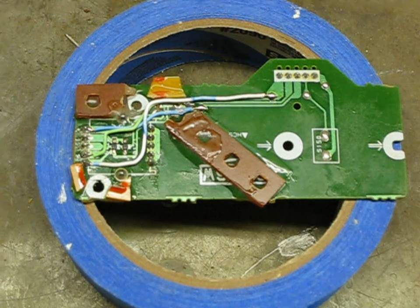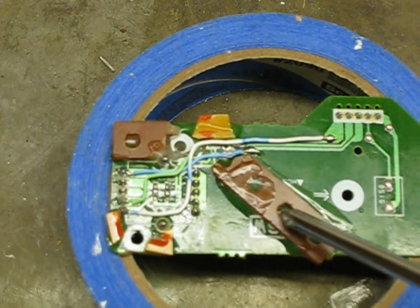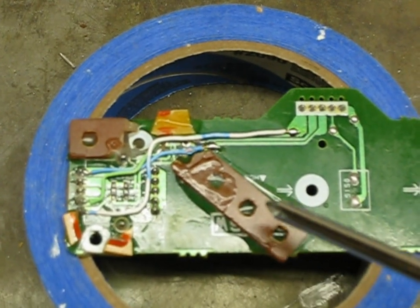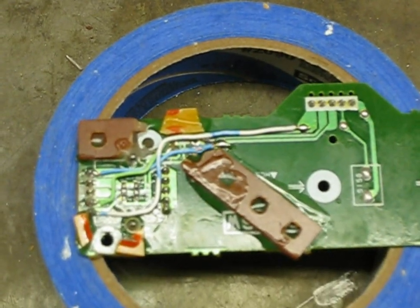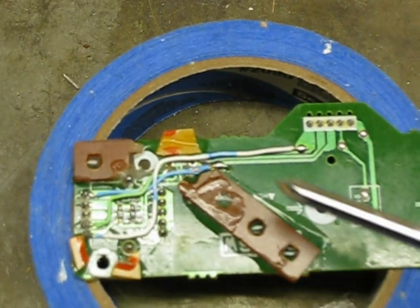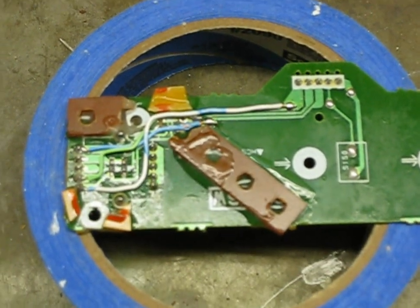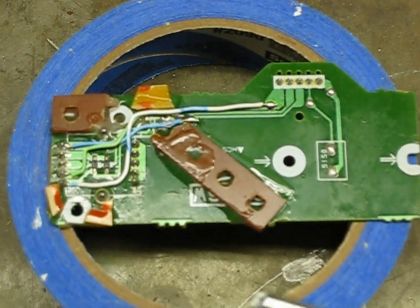My speaker selector and power switch board is finished now. I put additional bracing across the cracks — not necessary, but just to be safe. Epoxy. All that is is an old terminal strip that I had — I broke the tabs out of it. Same with the piece over here. Actually this whole section here was missing, so I put that in as reinforcement for that screw. And that's a little piece of the board from the impedance selector switch that was broken in the back, just to go over those cracks to be safe.